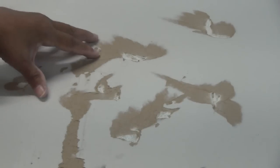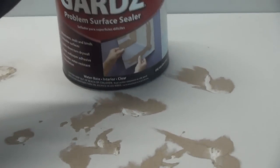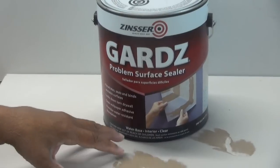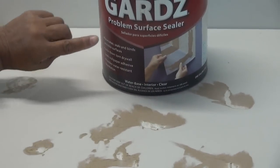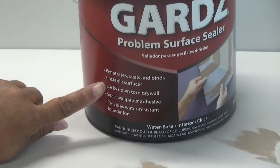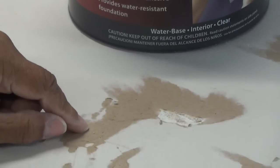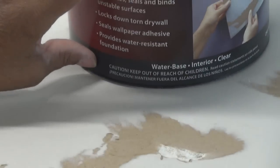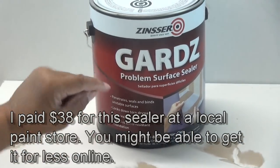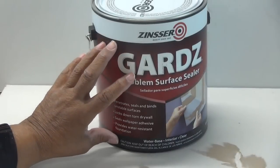Now it's time to apply a sealer on top of this before we apply our joint compound, and that's where this enters. This is a product that I have found that's really unique at addressing this particular issue, and it works wonders. If you look at the side of the can, it binds unstable surfaces and locks down torn drywall paper, amongst the few things it does. That's ideal for this particular situation. You can't purchase it in a home improvement store or a hardware store. You really have to find it online, and I'll place a link in the description below, or you can find it in a paint store, because this is really what professionals use.